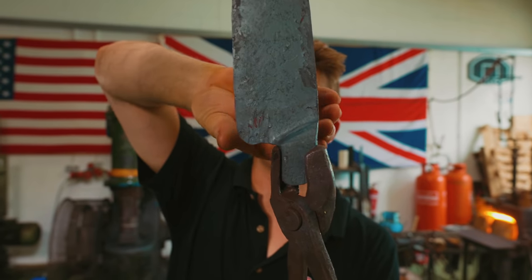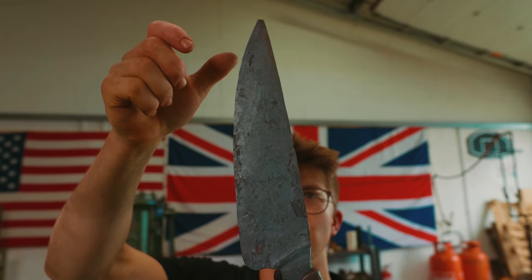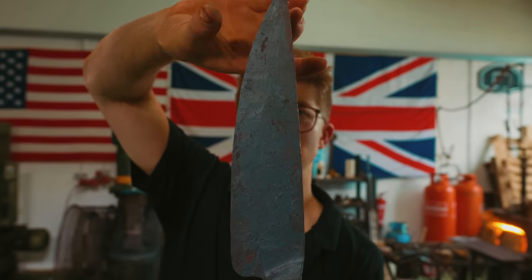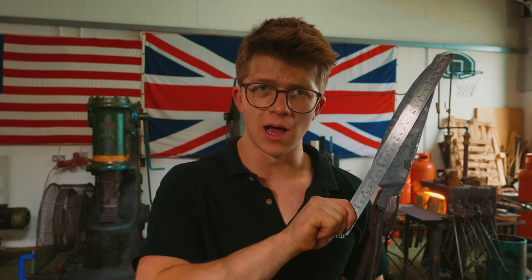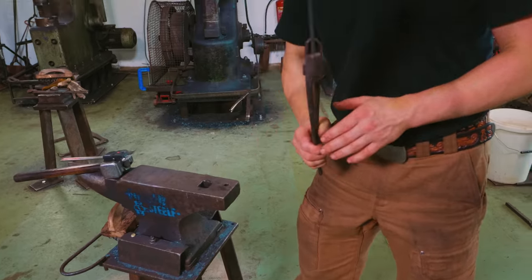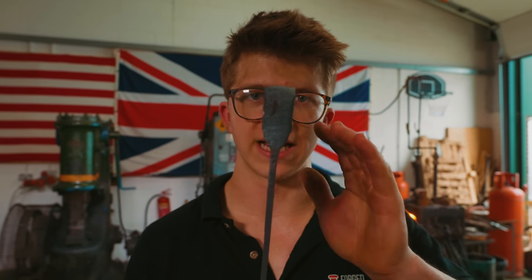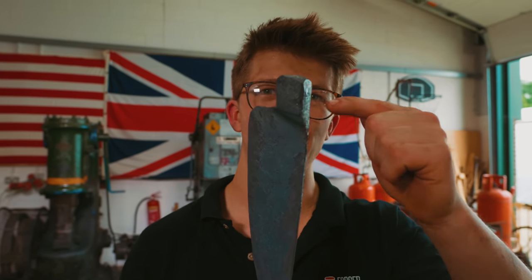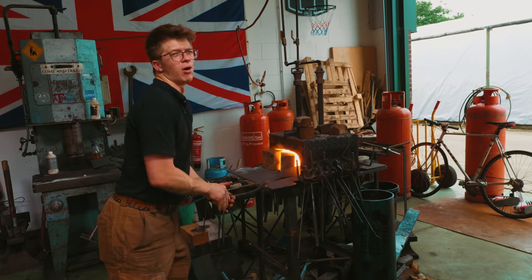I had trouble with too aggressively putting a bow in it before forging the bevel. We were able to fix it, and the shape is there. It is right smack on 9¼ inches long. Still plenty chunky, which is nice. Means we have lots of opportunity to work with it and make sure everything is just straight and neat and nice. First though, the last forging process is forging down our integral tang. So we're gonna put it in the fire this way for a little more heating and a little more beating.